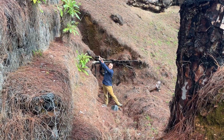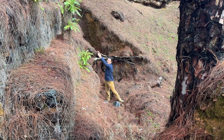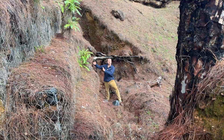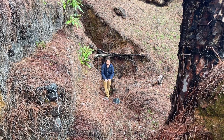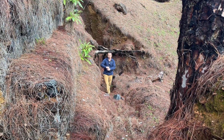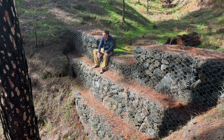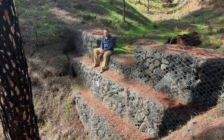This gabion is designed with the low spot just above me, so it's designed that water accumulates in this area and then goes down in a stepping motion. The critical part for these features, and also for others designed to slow water down, is to have what is called a splash apron. At the bottom we want something where the water can hit without causing erosion - something really hard. Normally we build this out of lots of rocks that disperse the power of the water. The good thing is at this spot there's bedrock, which is really hard, so the water won't cut this base away.